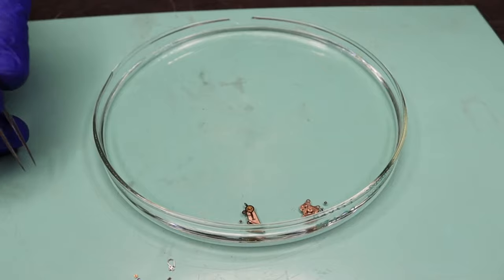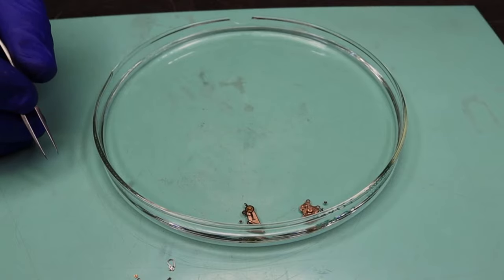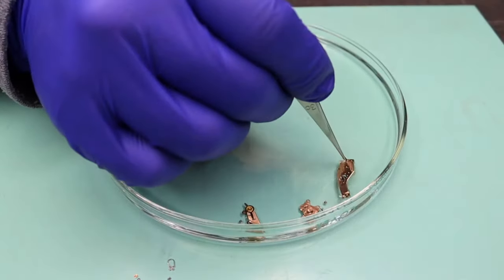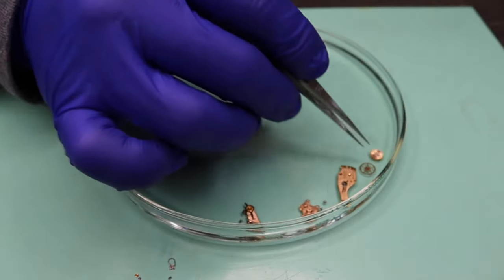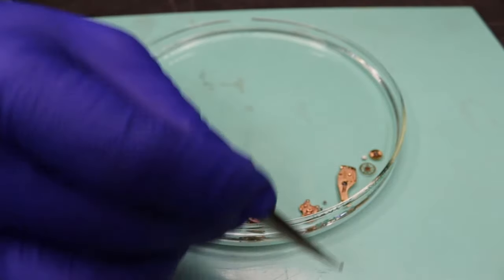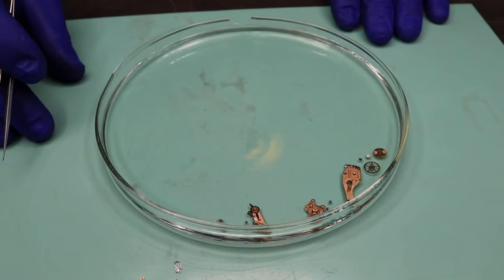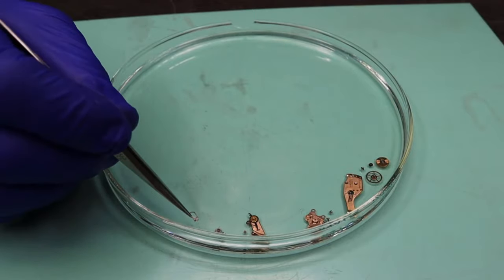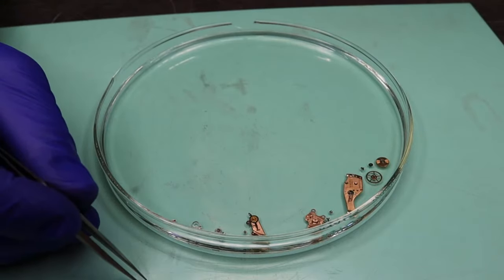I used to give myself a nice puzzle to solve where I would just put every single screw in the same basket and run it. This got me acclimated to what screws go to a watch, but it makes the repair process 10 times longer because you're trying to figure out what damn screw goes where, when it's just easier to have more parts baskets and put the screws with each bridge. So I don't like to do that anymore. I try to keep the screws with the part. Especially with chronographs, that is key. I think the Zenith El Primero has 42 different screws involved. Unless you want to cipher through 42 different screws every time you service one, just put the damn screw with whatever you took it out of.